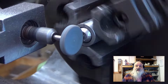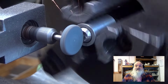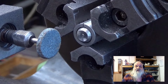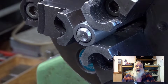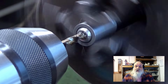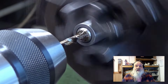At some point I noticed that it is better to keep the grinding stone still at the center and just feed it in with the top slide. After the hard skin of the ball was removed, the 5mm stub drill had no trouble drilling the needed hole. The end of the old thread was turned down to 5mm, which then fits in the 5mm hole in the ball.